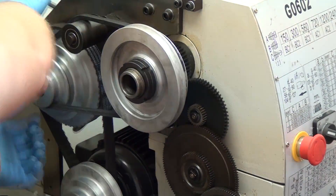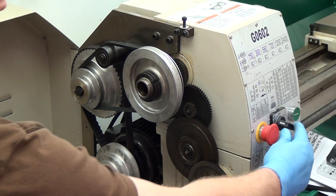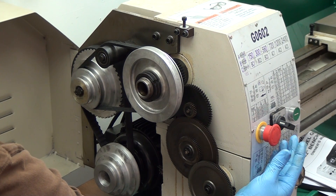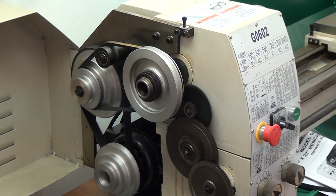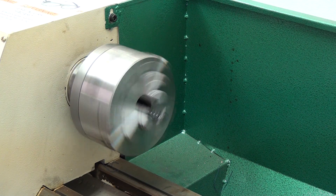To quickly remove the belt and go into the second speed, use the twist and roll procedure — not a problem. You'll need to twist the shutoff button, and you'll notice when I twist it, it pops out. Now you can reengage the drive by pushing the green button. Speed number two is 300 RPM — here it is at the chuck.